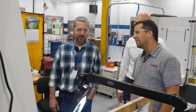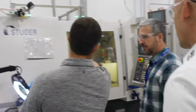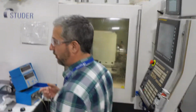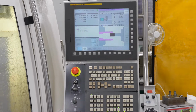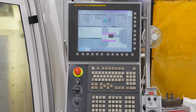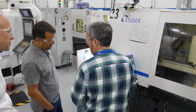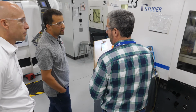Yeah. So the robot loads the lathe from the other side, and then it's honing out there? Well, it's an actual grind. Okay. So we're removing material. It actually probes first to make sure it's lined up correctly. It's fixturing on the outside of the part. So if somehow it's not in there correctly and you grind it, it's a scrap part. Right.